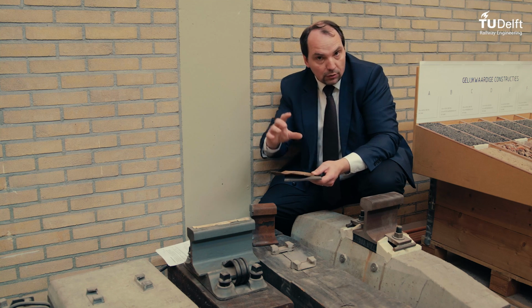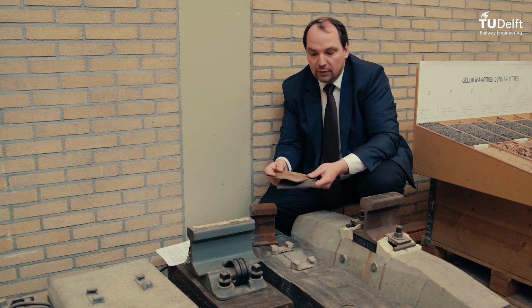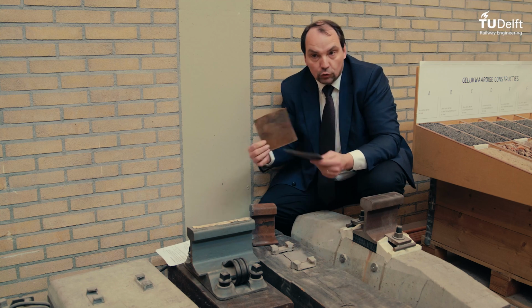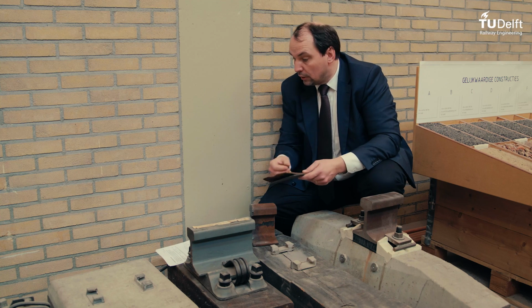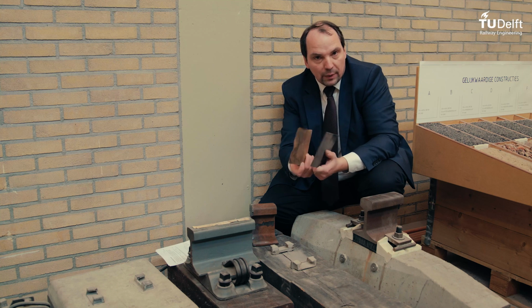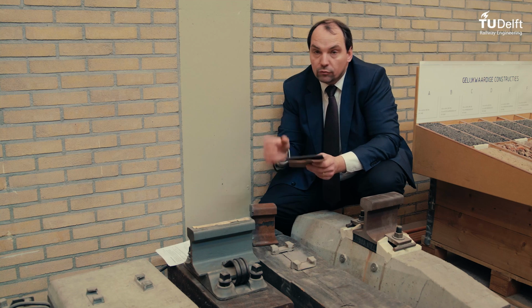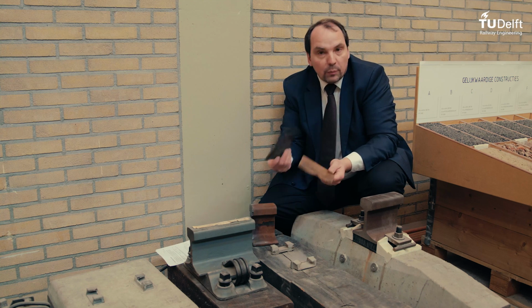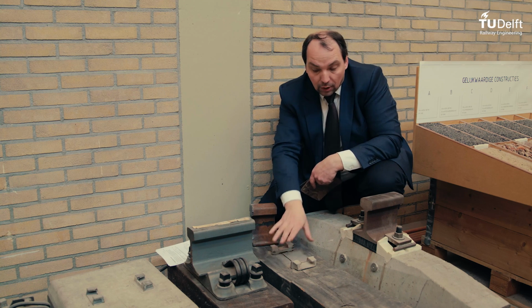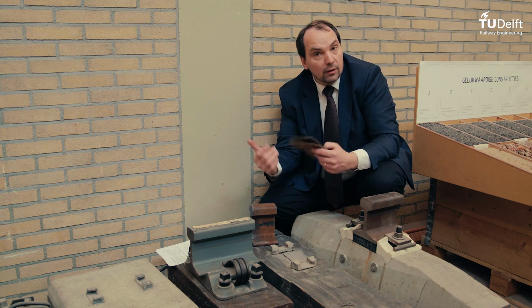So it is really a reduction of the stresses and also the energy you put in when a train is rolling over, and this energy is going inside this pad and it will more or less burn away because it is absorbing this energy. So when you talk about switches, then we have to see what kind of materials or rail pads we need. As you could see, at Delft University we did good research on what are the right rail pads or other damping materials you need between the rail and the sleeper, and also underneath the sleeper, like in the sleeper pads.